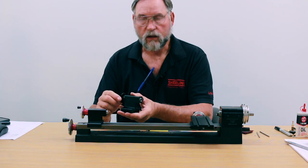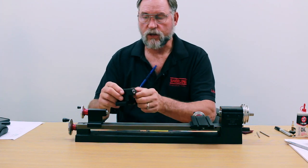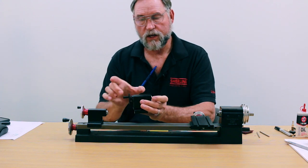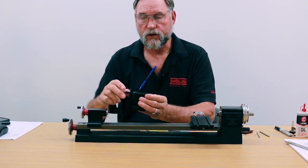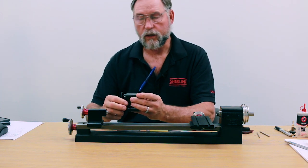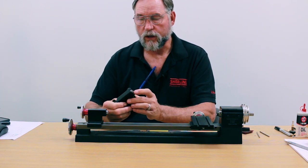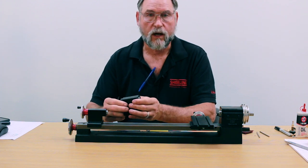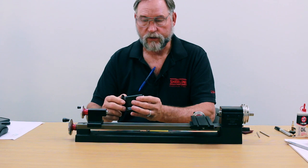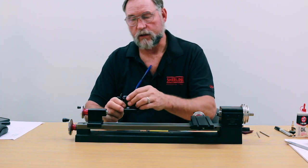This one is about a line to a line and a half, and that's as good as it's going to be. If you get it down to nothing at all, your parts are sandwiched too hard together and it'll be extremely hard to turn the hand wheel. You've got to have some play, and this is also for a tailstock that is doing drilling operations — if you have a couple thousandths of play you'll never notice it when you drill a hole; it's not that critical.